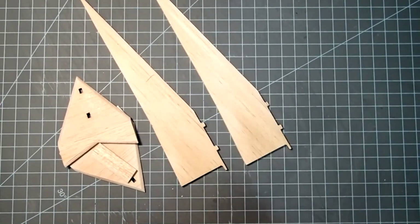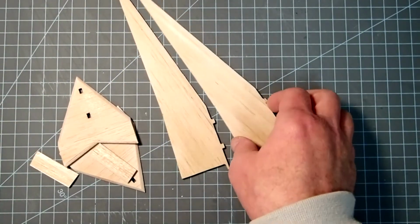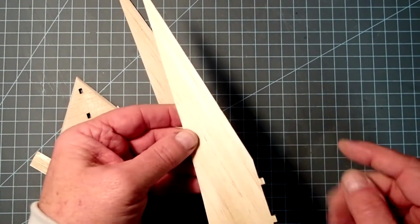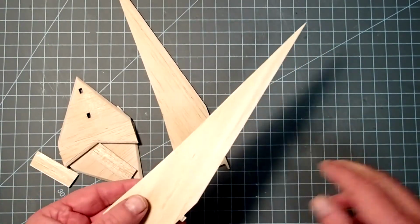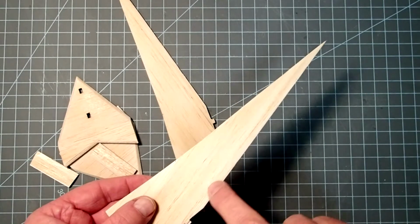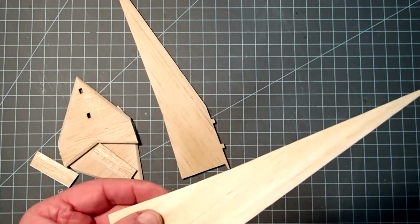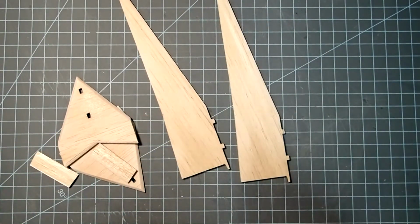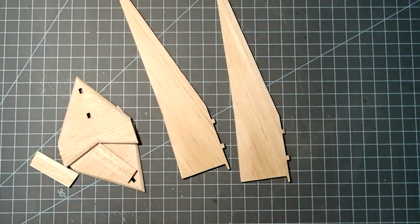I've put on and sanded down again another coat of the sanding sealer. And if you can see here carefully, there's just a little bit of a sheen left. And that's what we're looking for. There should not be an overcoat of sealer. But after sanding, you should still be able to see it in the lowest spots here. Now, if I really wanted to make this ultra smooth, I'd probably give it one more coat here and sand that again. But for the purposes of this video, I'm going to leave it at two coats and depend more upon the primer to fill in the rest.